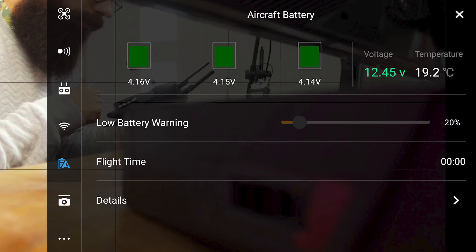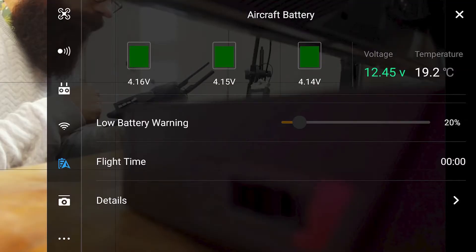There you'll see three individual units or cells and their corresponding voltage. A maximum fully charged voltage is 4.2 volts, and you want to make sure that the battery voltage does not go under 3.3 volts — that is when your battery is no longer able to store any charge, and that is where serious damage occurs. The second thing you should look for is that all of the cells are the same: each cell holds a maximum of 4.2 volts, and you want them to deplete their charge at about the same rate.